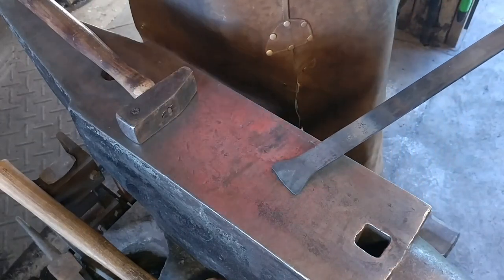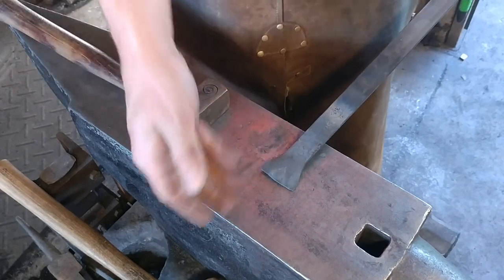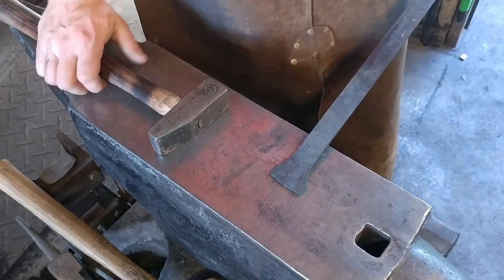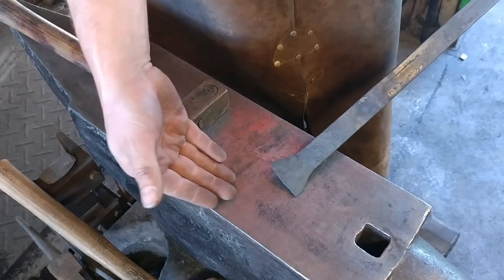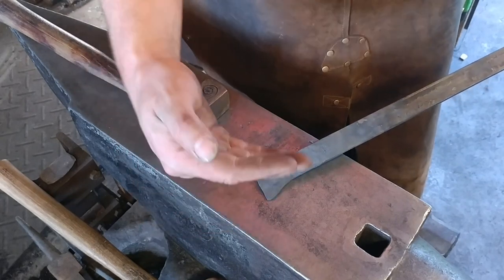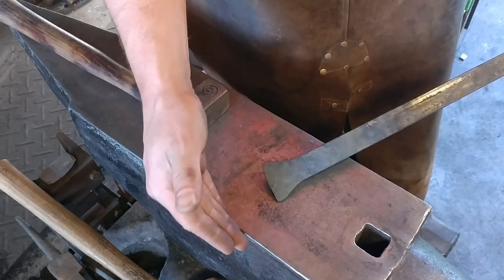That is how you take and do spreading. This operation is indefinitely valuable — it's one of the fundamental techniques of blacksmithing, used a lot in ornamental work and blade work of any kind. All edge weapons require some sort of spreading, thinning out, or widening of the material. When you get into more complex forging operations using power hammers, it's very handy to understand the process of spreading before moving up to power hammers — understanding how materials move with these fundamental techniques will take you further than learning any sort of project.